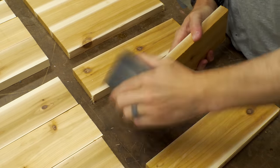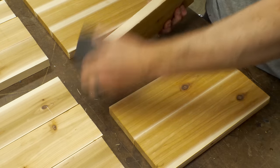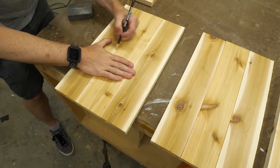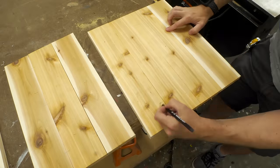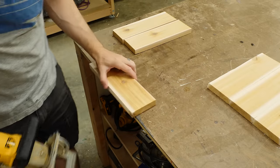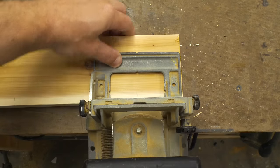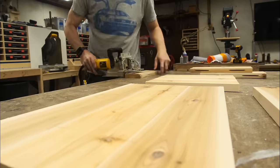To make sure they set really closely together, I sanded down all of the faces that would touch. To make these panels I used a biscuit joiner, and the best way to start is to line your panels up and draw a line across the joints where you want the biscuits to go. These marks end up being the center point for the biscuit joiner when you cut the slot — you center the tool on that mark, pull the trigger, and push the tool in. This cuts a slot, and you do that at every one of these marks on every piece.